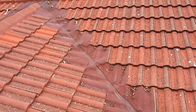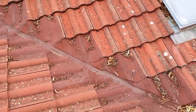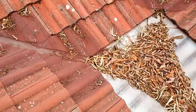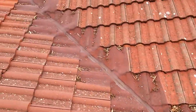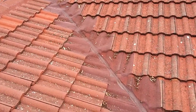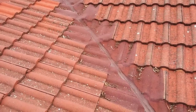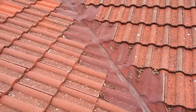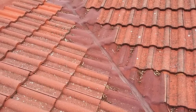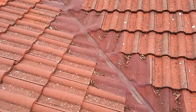I've found one of the most important things to protect with gutter guard is the valleys between angled sections of the roof. If the valleys get blocked with leaves, nuts and sticks, the water when it tries to run down the valley can't get down and it goes over the edge of the valley, ending up in your ceiling and leaking into your house, which nobody wants.